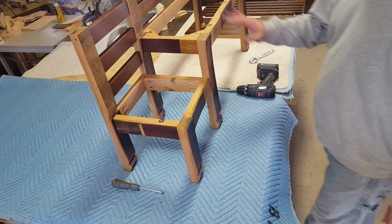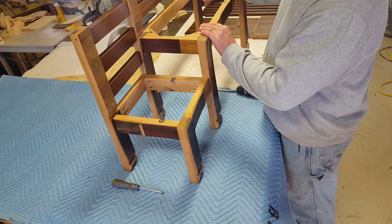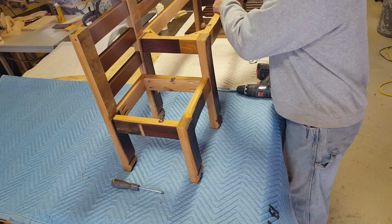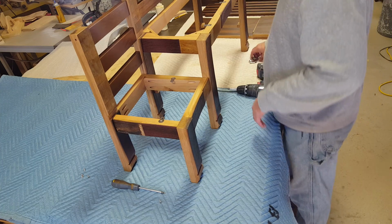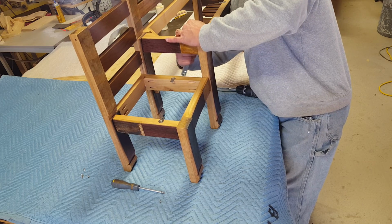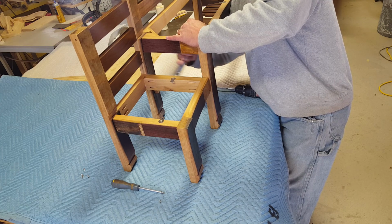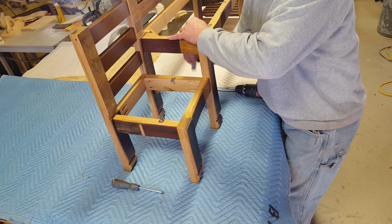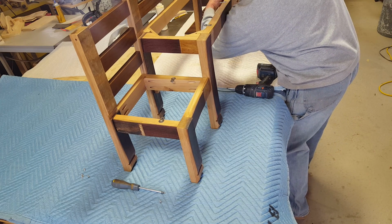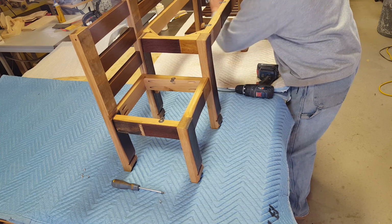Okay, so I have all these figure eights put in. There's 3 on the taller bench. Make sure they're straight, perpendicular to this apron. And then, this is where we tighten this up a little bit better. These are the leg bolts. Again, just get them snug. You could park a car on this. This will hold an adult easily, even if they stood on it. But I'm just snugging this up with this crescent wrench. There we go. Okay. So that's snugged up.